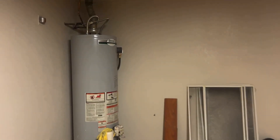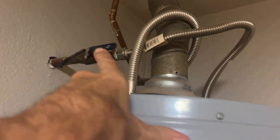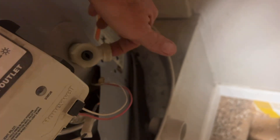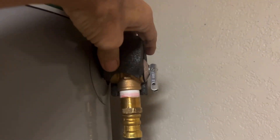You don't even have to drain your full tank if you don't plan on draining. Just get rid of about one quarter of the water. Just turn off your water up here for the refill, have your hose attached down here. Now, because I drain this yearly, this thing has a free flow — there are no mineral deposits stuck in here making it clogged up. That's why you need to do this every single year, and that's why you need to keep track of it. And don't forget to turn off your gas. But for the most part, you're not draining the entire system — you just want to replace your pressure valve.